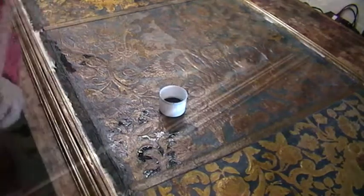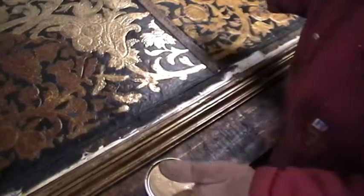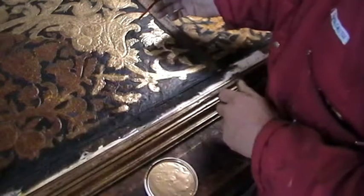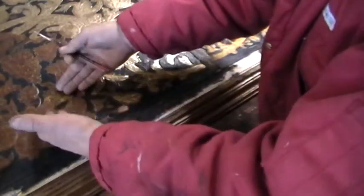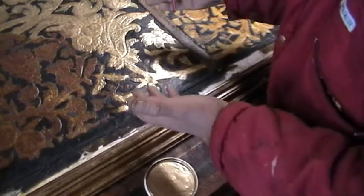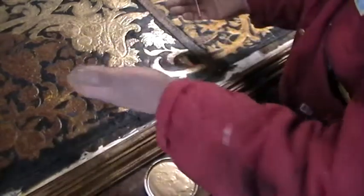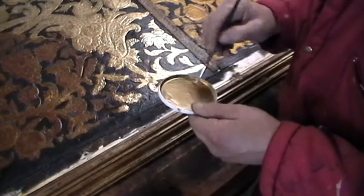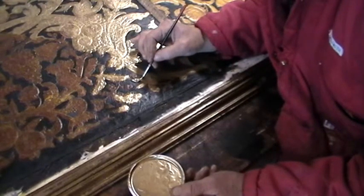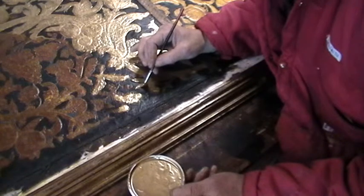You saw me doing the background the other day, so now I've done all the background in a PU paint which matches in quite well. We've started with the gilding — you can see here where the new gilding is compared to where the old gilding is. It looks a lot brighter at the moment but we will burnish it down. You can see the difference between the two colours: one's far yellower, one's far brighter, but it will burnish down. It's going to take hours and hours — you've got to gently go around all of these with the new gilding.